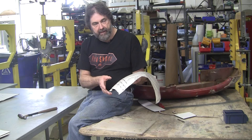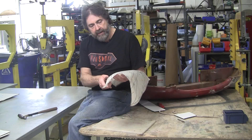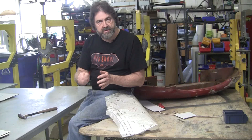The panels were chrome plate like, and they tried to bend this. This is 063/3003 aluminum, and they hadn't annealed it, and it was pretty stiff. So they were having a little trouble getting this to roll over properly. The way you roll it over is I have these little post dollies that I put in these little post dolly holders, and you can slap it over with a slapper with a leather face on it. So they were doing okay, but they made a few little mistakes.